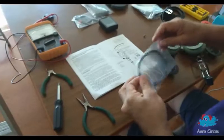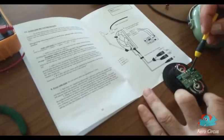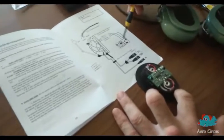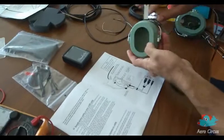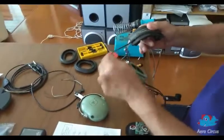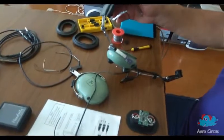To kick off the installation, we locate and open the packet containing the new crossover cable, then identify where each wire in this cable will eventually be attached to the new speaker units. The next stage involves replacing the crossover cable between the two ear cups. This is fairly straightforward if you pull out the old cable and feed the new one back through the same way as you go.